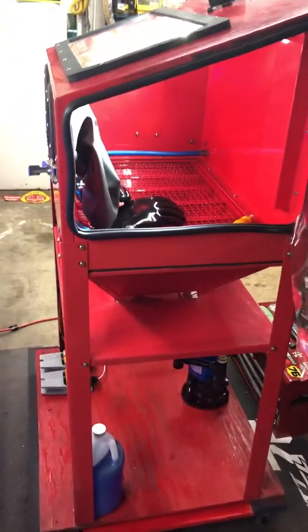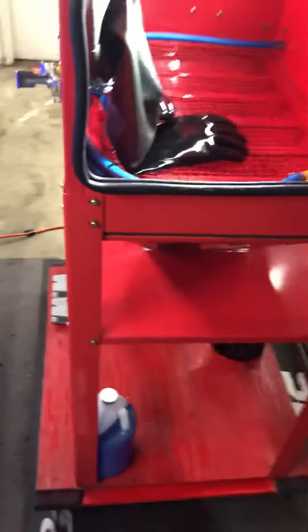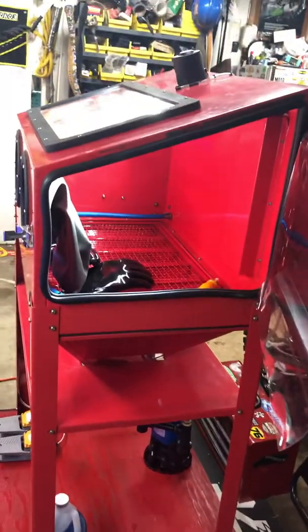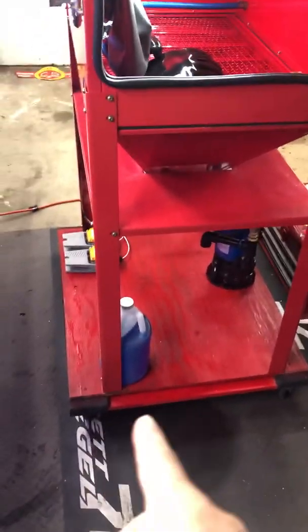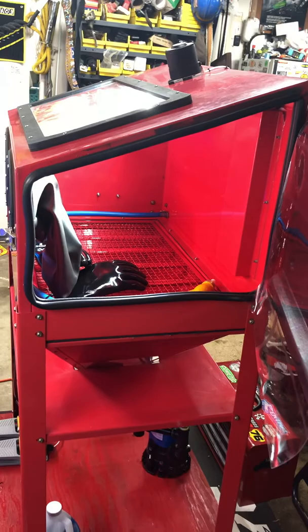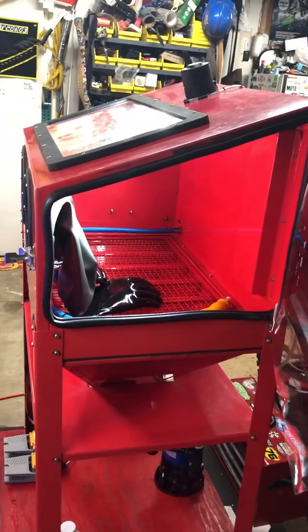That's the blast cabinet in a nutshell. If you have any questions I'm more than happy to answer. I also put car weather stripping around the door — I had to zip off a little section of metal for it to fit, but it helps cut down on any chance of leaks. I'll try to put links in the description to as many of the parts as I can. If you're in the Sacramento area and want me to build you one, reach out in the comments. Also, that blue bottle down there is from Vapor Honing Technologies — it's a corrosion inhibitor you put in your slurry mix to cut down on rust on your metal parts.